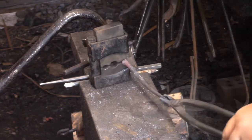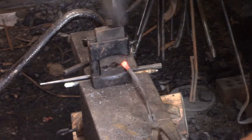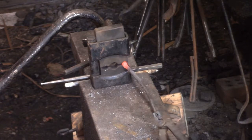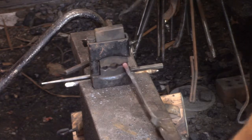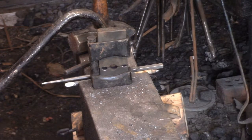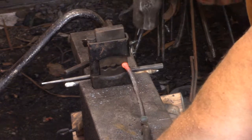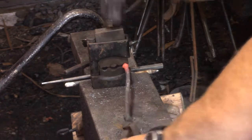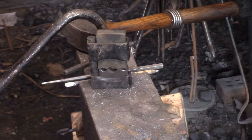You can kind of see there where I had a little trouble turning it because it's not straight. I'm going to be remaking this tool — I finally got some half-inch plate, those are 5/8ths dies — and I'm going to make a C-frame so I can get in both directions. I do want to save those dies though. It's O1 — I like working with O1.